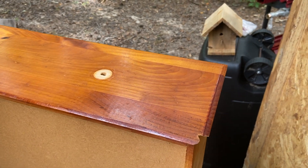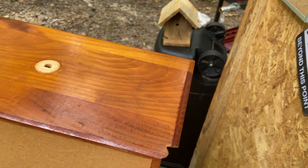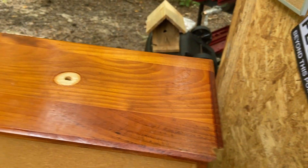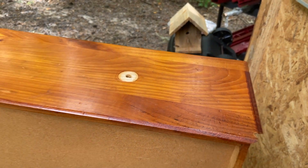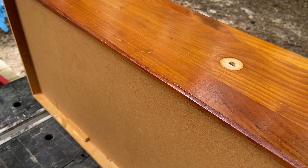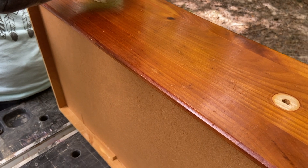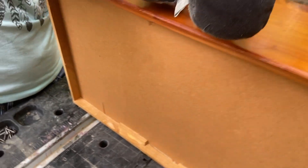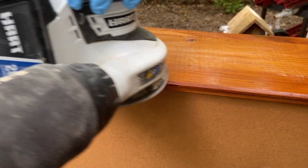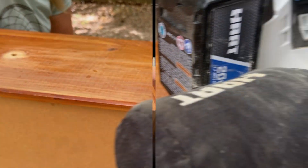With our drawers cleaned, we are ready to start sanding. This is the process that will show us, in essence, how hard this remake will be. The first sanding pass is the most critical. You can also use chemicals for this, and if sanding is too hard we might move to a chemical solution. Sanding is more labor-intensive and takes much longer than using a chemical stripper, but we have decided not to use chemical strippers in our processes. Additionally, sanding lets us see the wood grain the best way, while a chemical agent might change how the wood looks until it completely dries. So here as we are sanding, we start seeing what type of wood we have, what condition the wood is in, and what grain it has. That will become pivotal in deciding exactly how we are going to finish the piece.